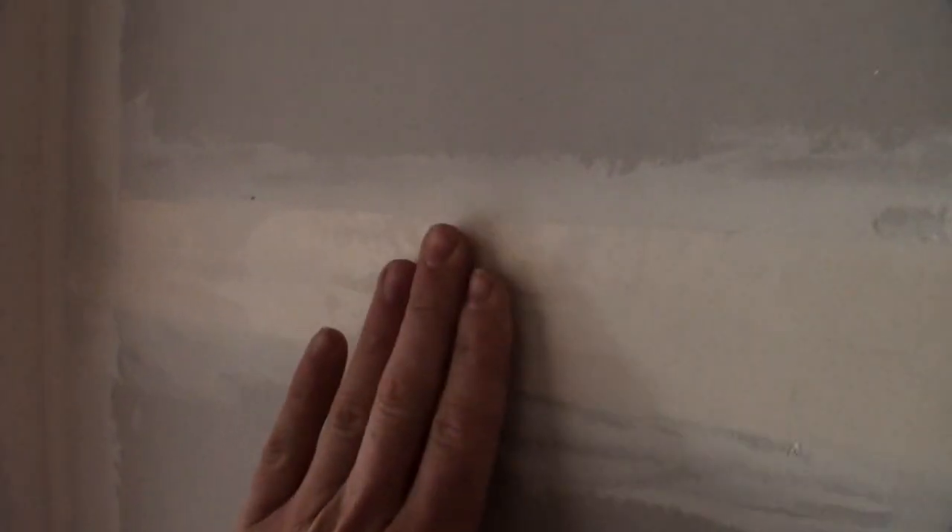We've pretty much seen everything. This little closet has just been taped — the tape is embedded in a small amount of compound. Once that dries, I can come back and do the two steps that finish it off to that level. I've got two or three more steps after this, then I can do all the sanding, and then the priming and painting.